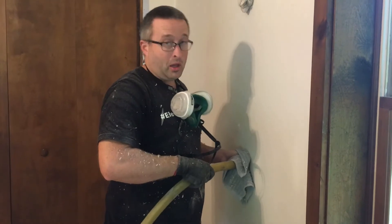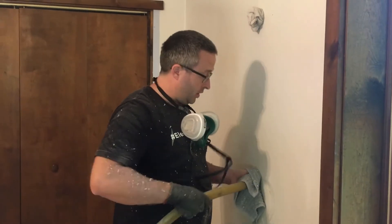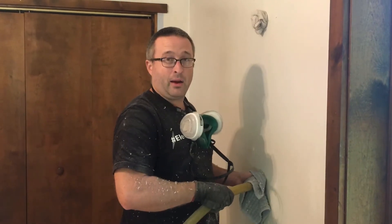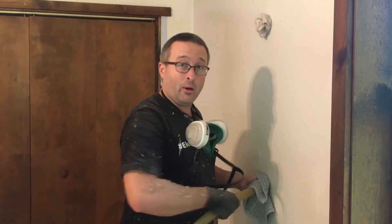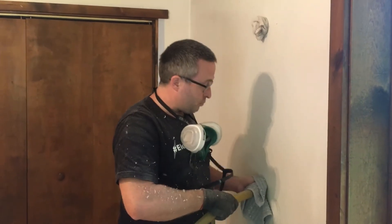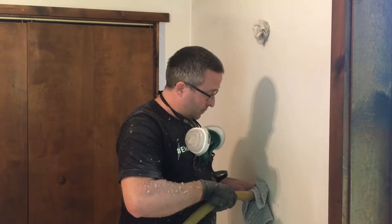When you do this a lot, this wall is a real pain. I'm 16 to 20 hours into blowing this, and I've gone 35 feet, which is obscene — but it's because its walls are stick-built and it's really, really difficult to dense pack.